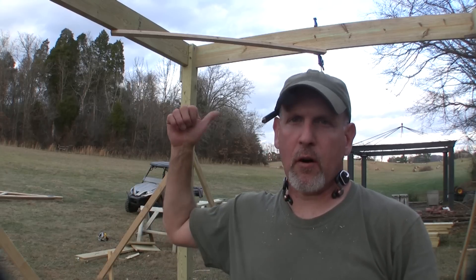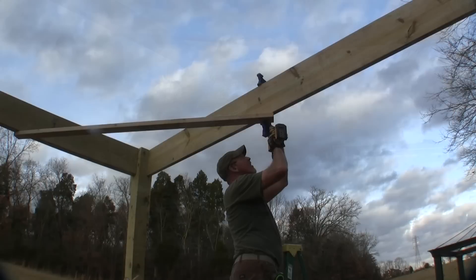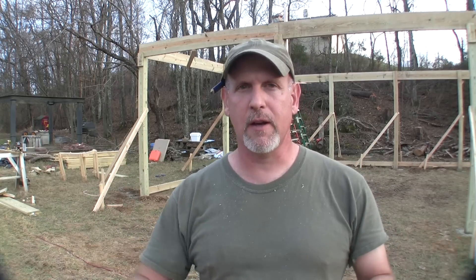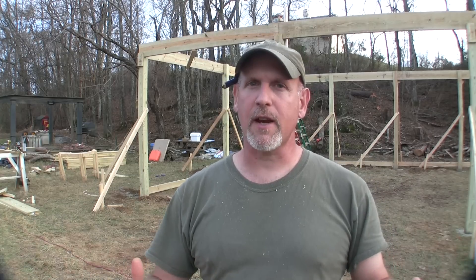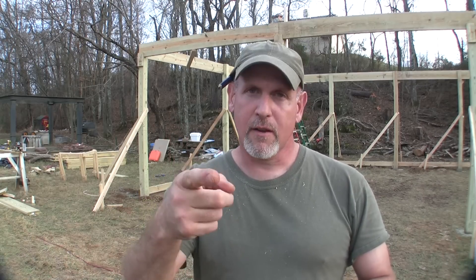The last thing I'm going to do today is put some cross bracing in on the corners to kind of take a wiggle out of it, and at that point it'll be ready to put the trusses on. I'm feeling pretty good about where I'm at now. I've got all the band around the top, two runs of band on the front and the back, all my seams break on a post, I've got it glued and screwed, and I've got my bracing in the corners - now I'm ready to set the trusses. It's supposed to rain for the next seven or eight days so I'm kind of shut down, but when the weather breaks this thing's ready and I can just come in here and set those trusses. I know this was a pretty long episode and I appreciate you hanging in there with me. Hope you enjoyed the video - maybe got something out of it, learned something, maybe got some of your own ideas. If you like my videos remember to give me a thumbs up, leave me some comments and subscribe to my channel. Thanks for watching.